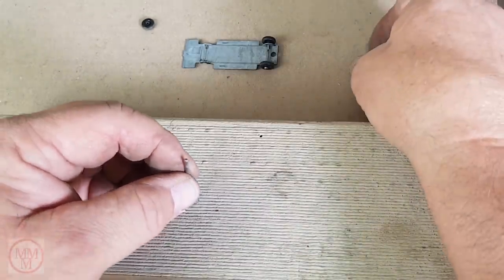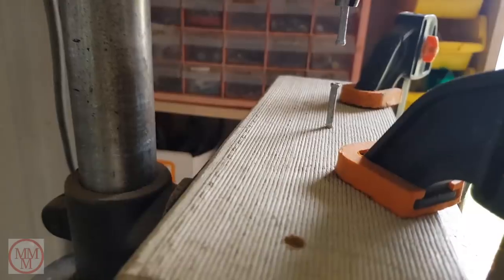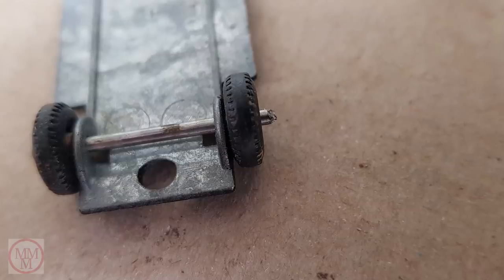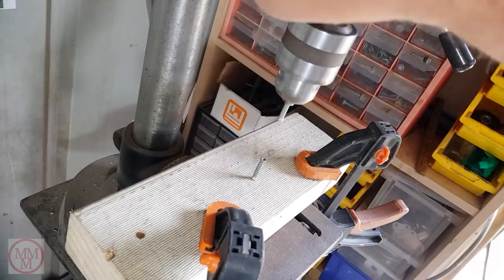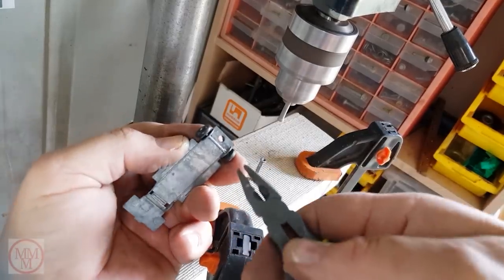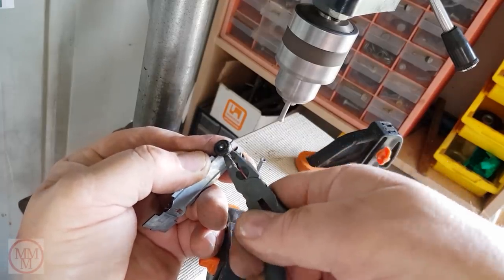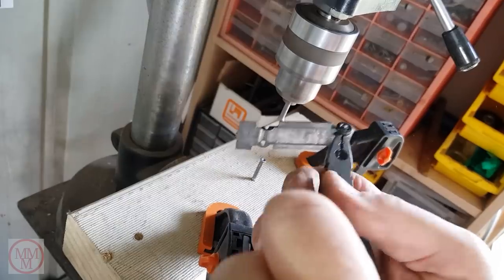Before you can use these nails, you have to check that they are in perfect alignment, both fore and aft and left to right. If not, when you're reforming the axle, you run the risk of putting sideways pressure on the axle, and it can cause it to bend or distort. This is a picture showing you just how much metal material you have to work with to form the new end of the axle. When using this tool, it's necessary to hold the axle pin extremely tightly using some pliers to prevent it from spinning — if it spins, no deformation of the end of the axle will take place. You also want to hold it as close as you can to the top of the axle, to reduce the chance of bending it.